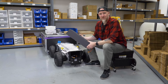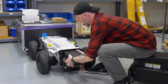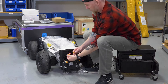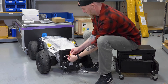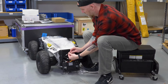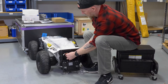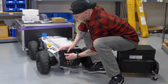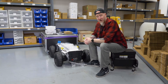To put a new charged battery in, just do the opposite. Pull your cables out of the way and slide your battery in. Connect your two power cables, then connect your data cable, which is the small one — push it in until you see the clip attach. Tuck them behind the handle on the battery, then close your door, hold it tight, and put your latches down. That's all it takes to change the battery on the Hunter 2.0.